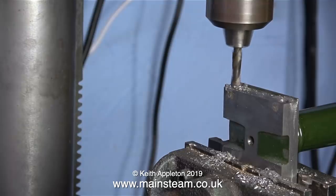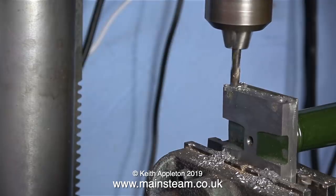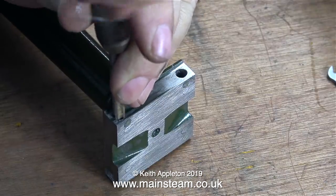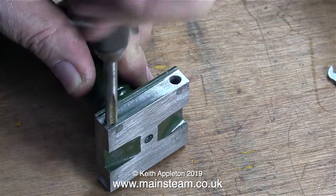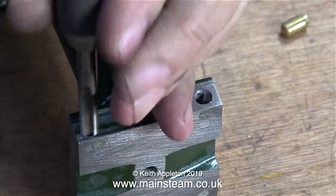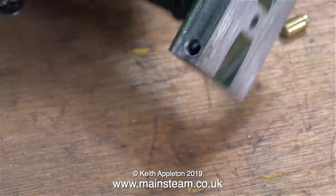The two metal plates that sit on top of the column are going to be pre-drilled to take the bearings, so they will also act as a drill guide when I drill the cast iron. It's always good to think ahead, and in model engineering, thinking ahead is of paramount importance. Before I make these videos I actually sit and think about what I'm going to do — I don't use a script; the words appear when I look at the pictures. In this clip I'm threading the holes in the side of the column quarter by 40 threads per inch. I drilled the holes quite deep, so this will be a really solid plug, which it needs to be because it's holding a fairly vital part of the beam engine and I don't want it to wobble about.